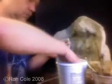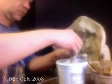You'll probably do this in a couple of batches of plaster, and one thing you'll notice is that when you start adding newer batches of plaster to older batches, the newer ones will set up more quickly. And you can start adding your burlap. I usually just dip it in and scrape the excess off, and like bandages, just lay them over the surface until you've got a whole patchwork over the entire surface.